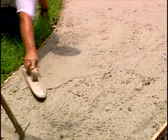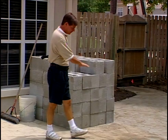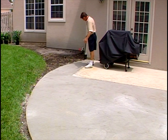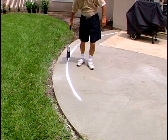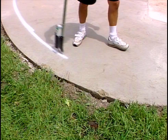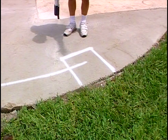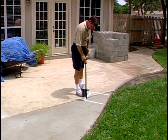We've moved our concrete blocks into place. Let's talk about this design, this little knee wall that will outline the patio. I'll start in the corner and give you a feel for where we'll have a break in that wall. This low wall will go in about 16 inches altogether, and at some point we need a column here for a break. That'll be our entrance into the lawn, and then our wall will continue moving in this direction.